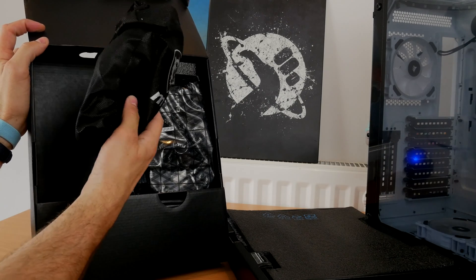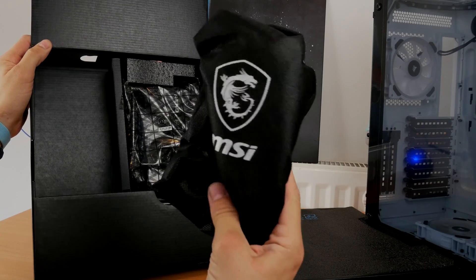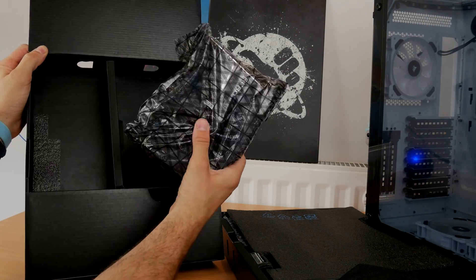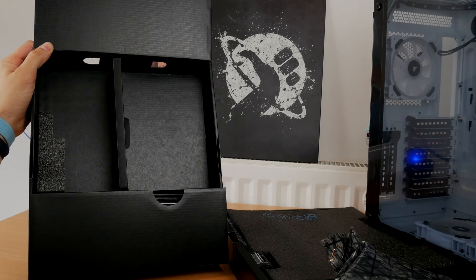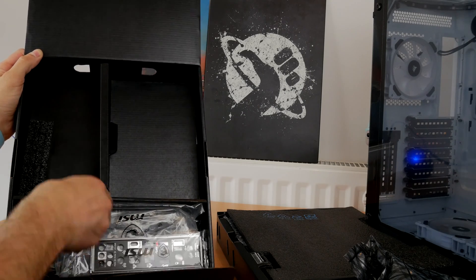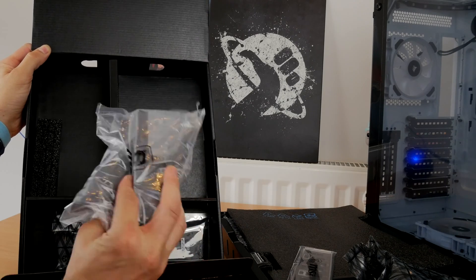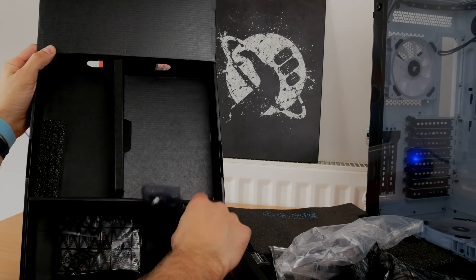This is a very capable motherboard with a multitude of different inputs. It's power-hungry but it has the power to support quad-channel DDR4 out to 4200 MHz with 8 DIMMs. It also has 4 PCIe slots allowing you to SLI up to 4 graphics cards, which is just mad. It has onboard storage for 3 M.2 NVMe drives as well as an expander which we'll show in a minute.